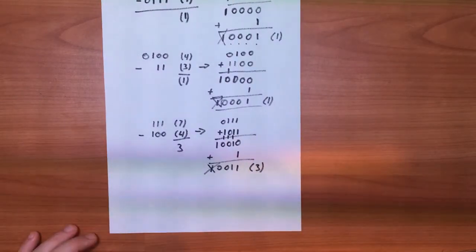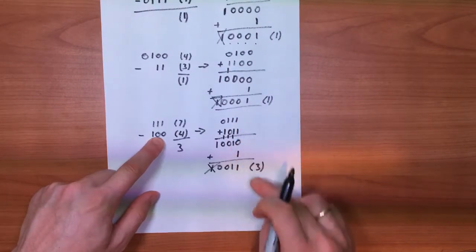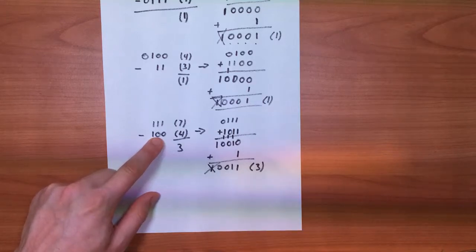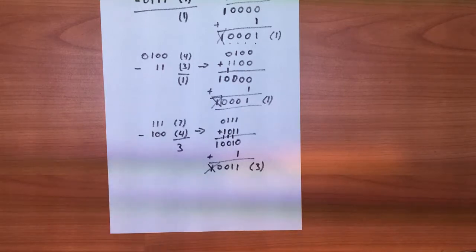So it looks like we have found a reliable way to do subtraction by building the binary complement of a number, adding it, adding a 1 to the result, and chopping off the 5th bit. And with that, we have successfully mastered binary subtraction. There are videos on YouTube about 9's complement and 10's complement, which you may want to watch, which are useful to understand how this concept is applied to the decimal system, where it has also been used in the past for mechanical adding machines. Not so much used today anymore, but certainly the binary complement is used every day in our computers.